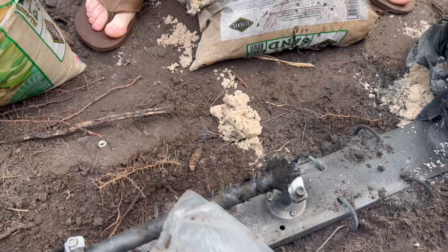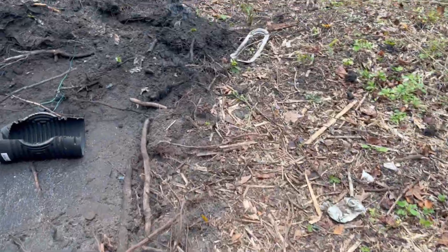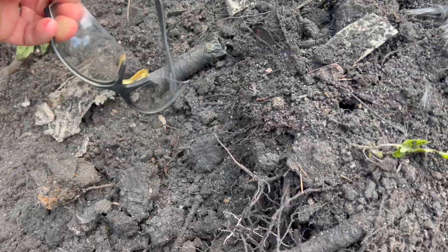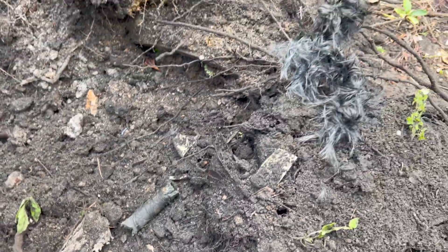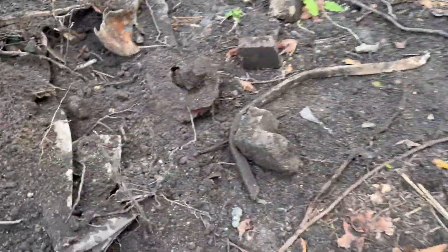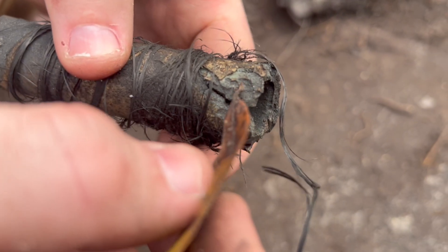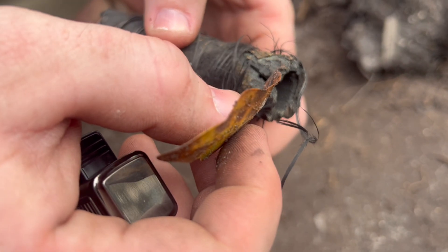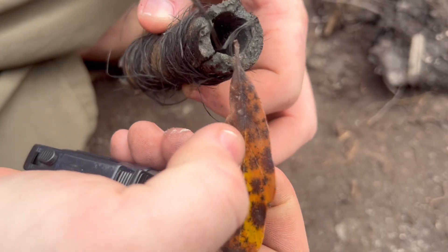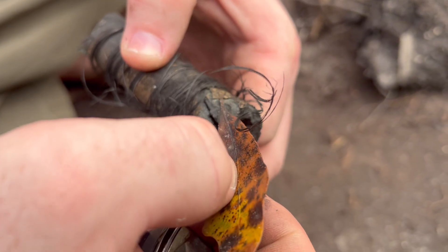That's what got ejected — there's a bunch of carbon right there that was on fire. Looking at the recovered nozzle section, you can see surfaces on the outside that are charred and concave, going back along it. This is a burn-through — the flame front came in and was burning back along the grain from the very beginning.